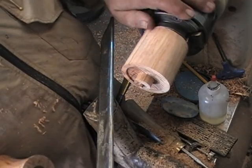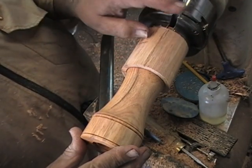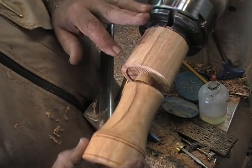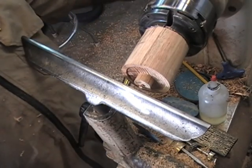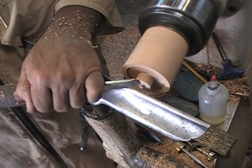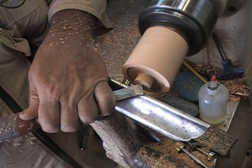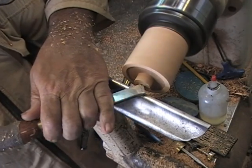Our next move is to make this piece overall pleasant by rolling this around, turning this to a cap. That's going to be my overall height to have this break fall at the phi line or the golden mean. So that'll be the top of my piece. I will be putting a 1/4 inch hole right through this for the mechanism to work in or pass through. And we do that with a regular drill bit. We create a perfect depression for it to start in, so it runs through the piece.